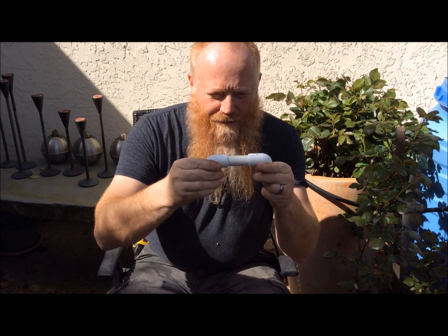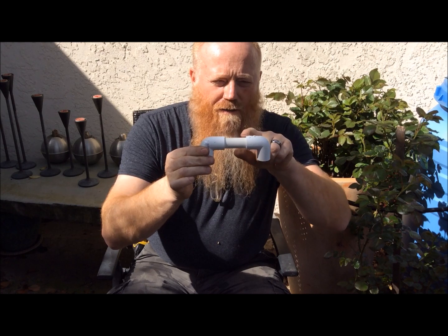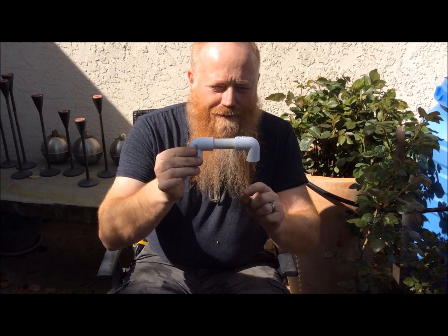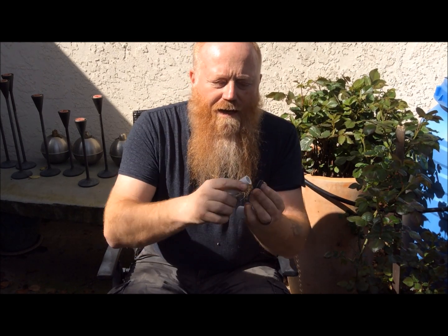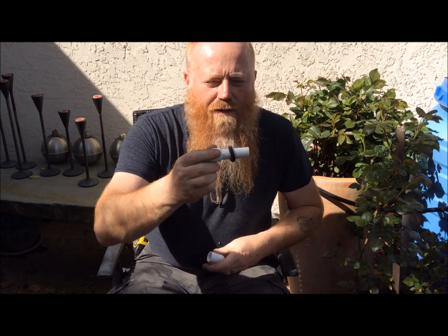For the drain we're actually doing a drain siphon system. You use a half-inch piece of schedule 40 PVC piping and two 90s. You set it up so it sits in the pipe with an O-ring in the middle. The water level will stay at a set point and once it drains it will siphon all the way down. This piece will go about two inches up on the pipe and then you install the O-ring and push the half-inch pipe into the O-ring to make a water-tight seal.